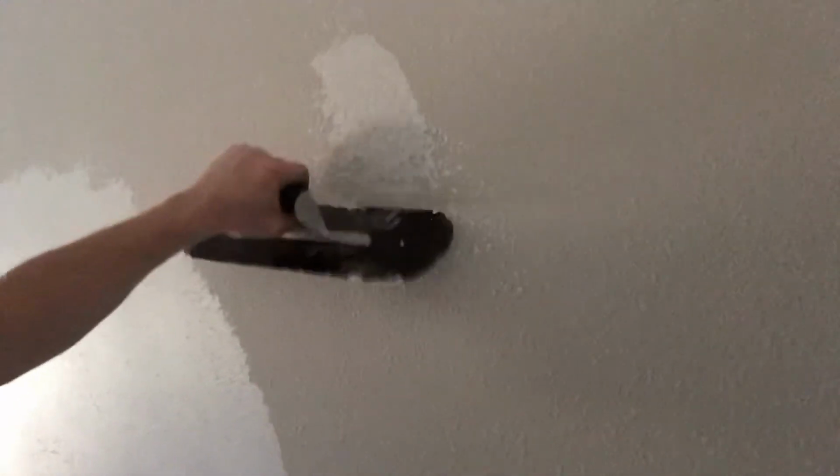And that's called millage. So, I told you the mixture, I showed you the tool that I'm using, and I showed you the application technique. The blade is held at a 45-degree angle on the wall when you're spreading your compound. If you want less compound, you put this much on, you want to put as little as possible. You hold the blade literally, practically at a 90.